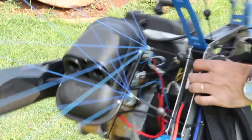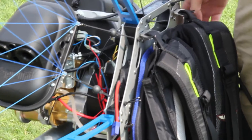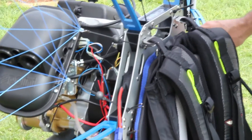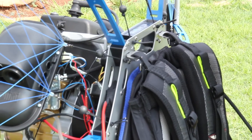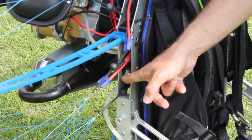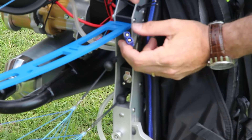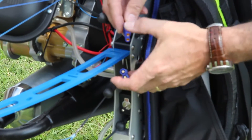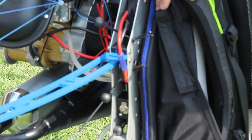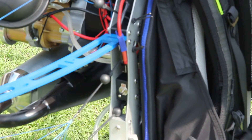On the frame — just turning it slightly — you'll see that the battery is now inside here. It's got a blocking position on this side, a little blocking port, that'll stop the battery from sliding out. On the other side, there's your master switch. So make sure it's in the off position before you plug the battery. You'll see that the battery can only go in in a specific orientation — flat side, flat side, round and round. Plug that in, and now once you're ready to go, arm it, and then you can use the throttle.